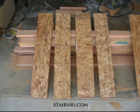I'm going to show you a way to lay out the plywood or the OSB to provide a few examples of how you can get a couple of extra risers out of a sheet of plywood or oriented strand board in some cases. But you're not going to be able to do that with the stair treads, so remember that.